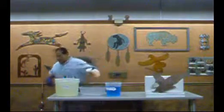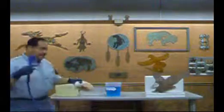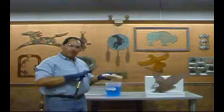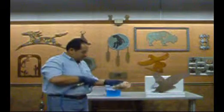So once you do this here, you want to go ahead and dry your steel, because if you don't dry it, this is a chemical finish on steel, and what's going to end up happening to the steel, it's going to rust on you. So you want to remove the moisture away from the metal as soon as possible.